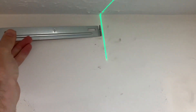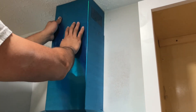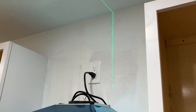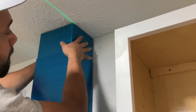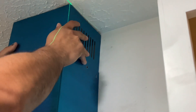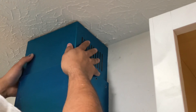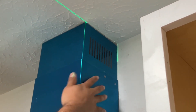Checking for level and then putting a line up here — we used a laser level just to know where to mount that top bracket. The chimney is super easy; it's two pieces that connect together. One sits on top of the unit, the other one kind of attaches with a little clamp to that little mounting bracket that we screwed on to the top of the wall. You just have to push it up and then bring it down on top of the two little clips, and then there's a couple little set screws that go in the side, and then the chimney's on.